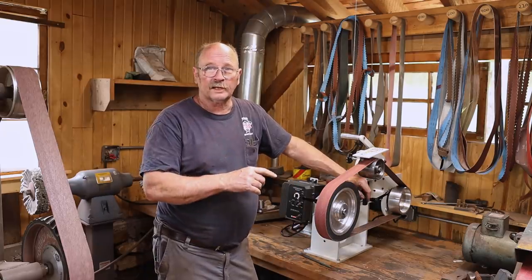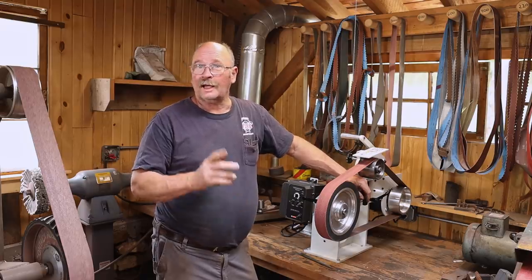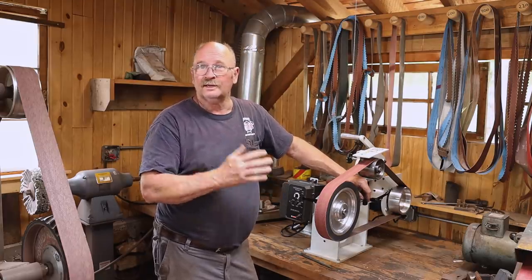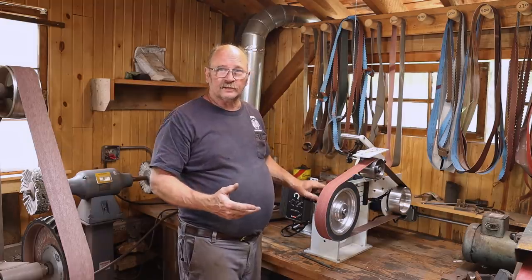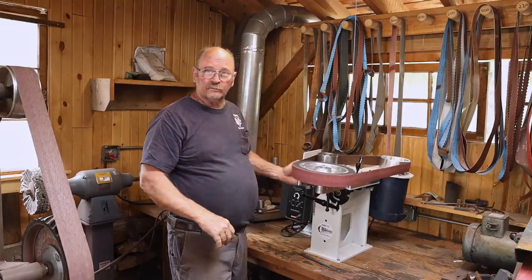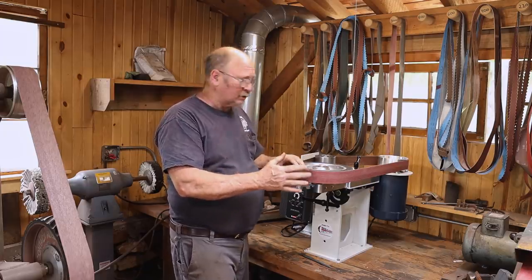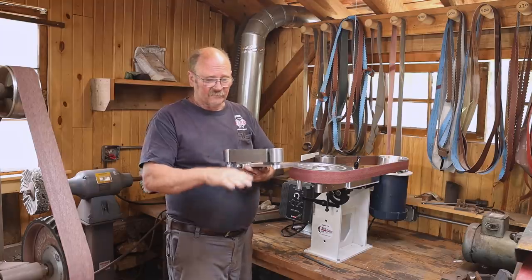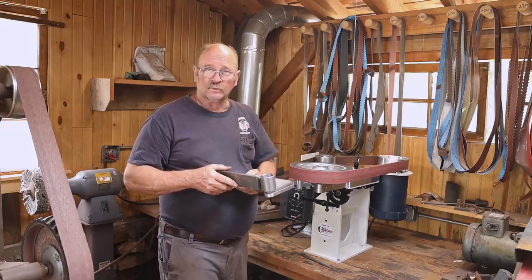As I said earlier, I'm not being sponsored by KMG. I paid full price for the grinder — in fact, they have no idea I'm even doing this video. So hopefully they like the video as much as I like the grinder. I am, on the other hand, sponsored by Combat Abrasives — that's where I've been getting all of my abrasive belts and I've been very happy with them. If you need some, there's a link in the video description with a discount code BLACKBEAR10 so you can get a discount on your order. Now tilting this thing couldn't be easier. You just release one lever to loosen it up, and then it's got a spring-loaded detent here, and you can spin it over sideways. Using this wheel sideways probably isn't going to be very practical, but putting the platen on there sideways is going to be really useful, and the tool rest system will come up here and sit right next to this platen, which is why I went with the tool rest I did.